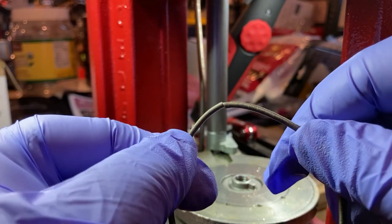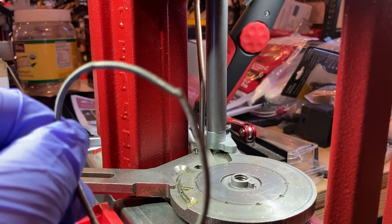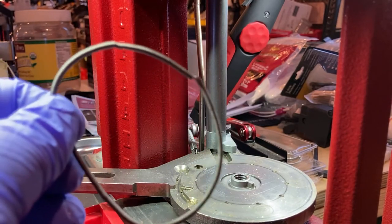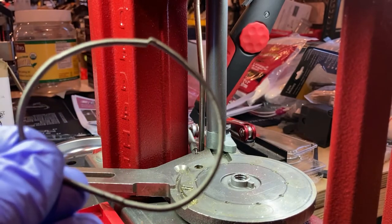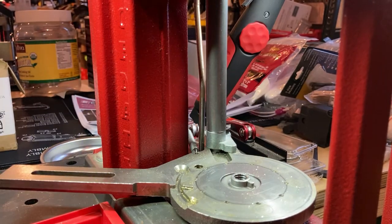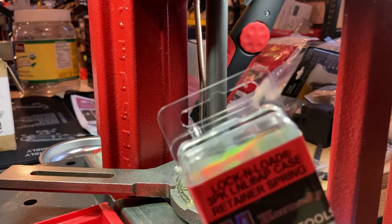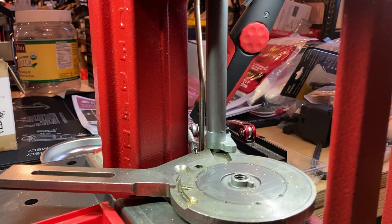You can see that big kink there — that probably happened not too long ago. Sometimes if you have a little jam or some issue on the press, you go and pop the case out, and over time the spring just gets little kinks and mangles in it. So it's time to go ahead and chuck this one. We've got a new case retaining spring — we got a three-pack of these. If you're going to have one of these presses, I'd recommend keeping a few around. We'll go ahead and replace the spring and get rid of that old one.